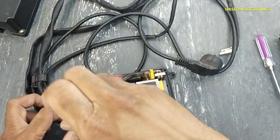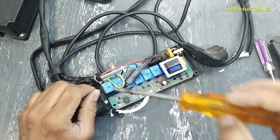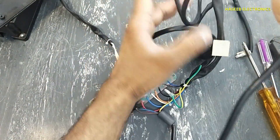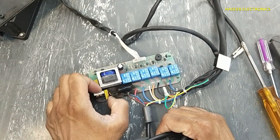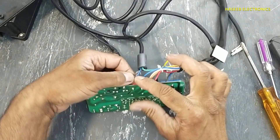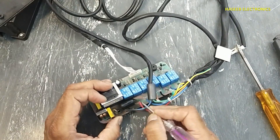There is a burning sign here and this component is damaged — this MOV is short-circuited. The metal oxide varistor is damaged. Whenever the voltage exceeds its rated limit, this MOV protects the circuit from over-voltage. At that time it becomes short-circuit and protects the next circuit. It is always connected between line and neutral.